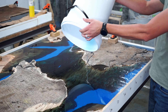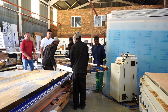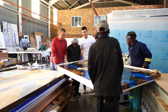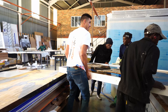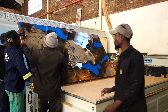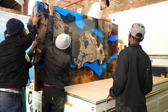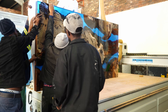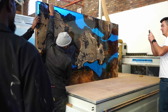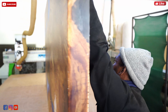Continuing with the video — we are using a deep casting epoxy which technically we can cast the whole table in one go, but we found that casting in layers over five to six days, casting around five layers total depending on slab thickness, reduces the amount of bubbles. Since we don't seal our live edges, you will always have small micro bubbles on the edge of your slab. Casting in layers helps us remove 98% of all air bubbles.